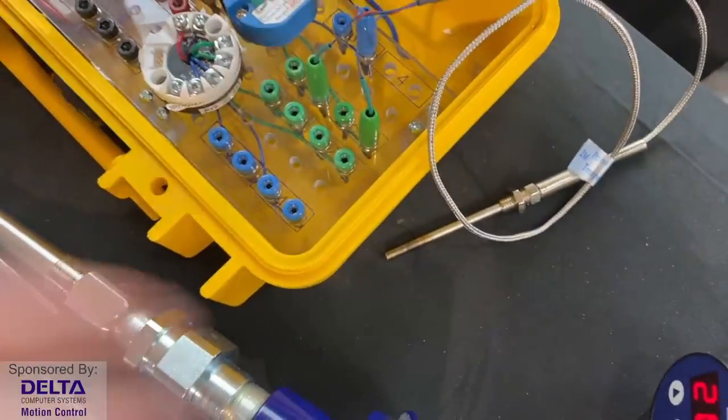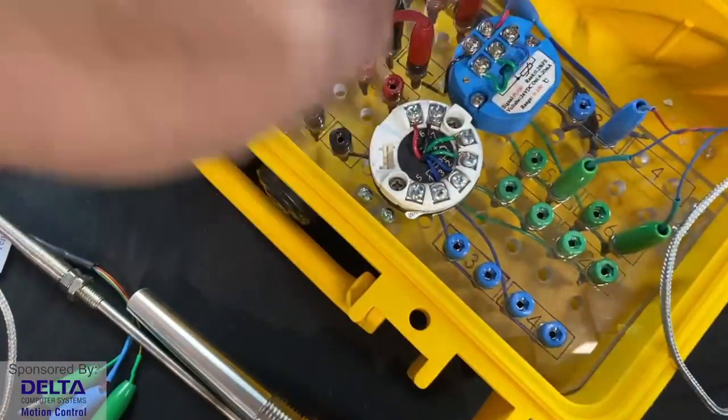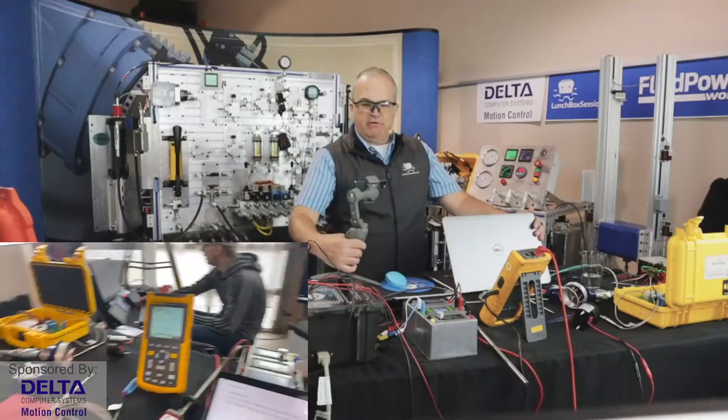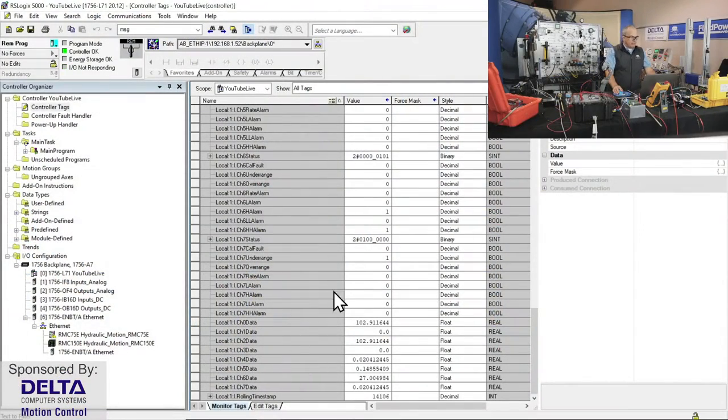So the RTD that I've got connected here and reading the ambient temperature here in the room is transmitting through the transmitter and then into the PLC. And let's just have a look here on my PLC's programming software. I'm just in program mode, for those of you who know RSLogix. I'm not in run mode, I'm not running any particular logic, but I've opened my controller tags, and I've jumped down to my channel data for my analog input card, and here on channel 6, there it is. There's the RTD reading temperature.